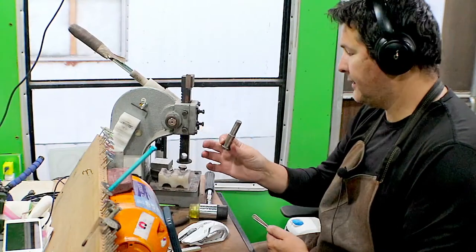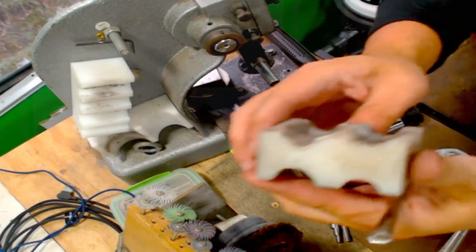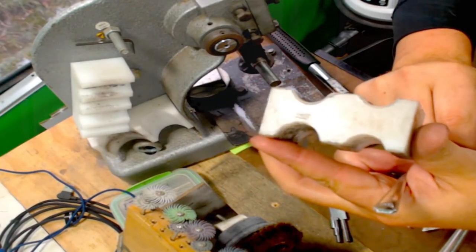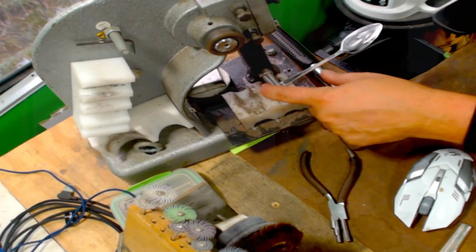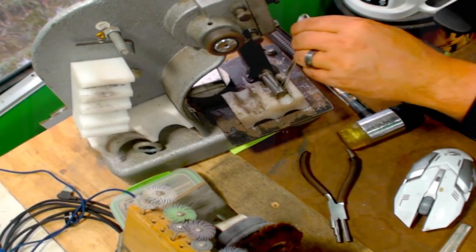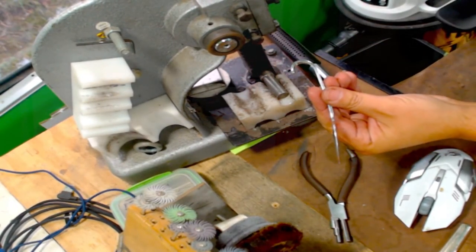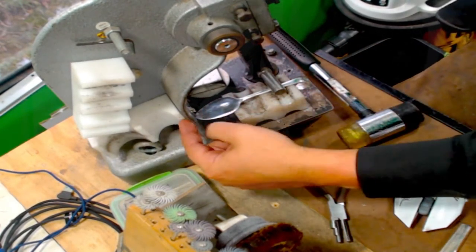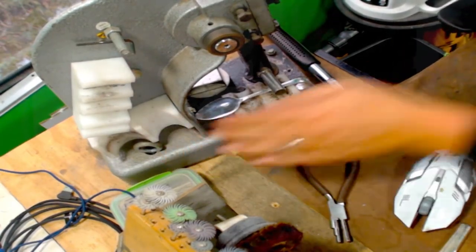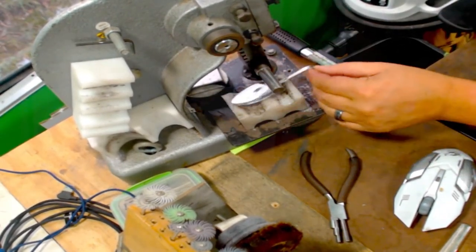I'm on the second pin. And I'm in the shallowest part of the block. And I start with the pattern down just over enough to be able to get it to stick on the other side. Just get my nice candy cane there. And then I push the spoon right up to the metal. I've almost thought about cutting like a little channel through here just so the spoons will slide through. I don't think it'll make too much of a structural difference.